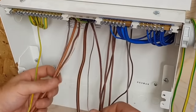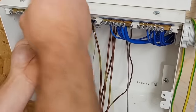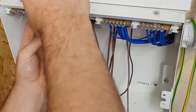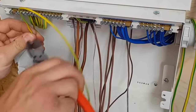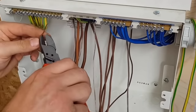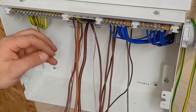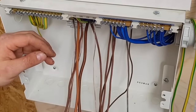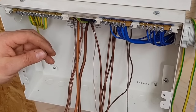But yeah, I'll tell you what I find as well, that feeding the switch, and if you buy Hager, by the way, Hager has now got a neutral terminal in the back of the switch. So that makes things a little bit easier. It's almost like a double pole switch. It would be nice if you see in the back of a plastic switch, if one day they sort of copied what the sockets do and maybe put like an earth terminal which connected to the 3.5s, that would be nice. Well, big debate, and can you leave connectors floating in the back of the box?